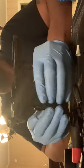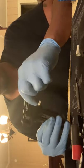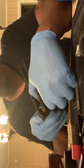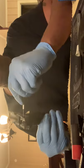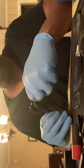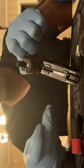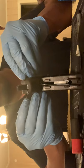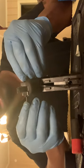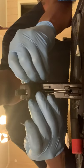As such, I'm going to use that punch and rock these pieces. I normally start with a little smaller one so that I can find the holes easier. Line them up. And bingo, there it went through the other side. Start back with my pin. Going back and let my punch guide it right back through that hole.